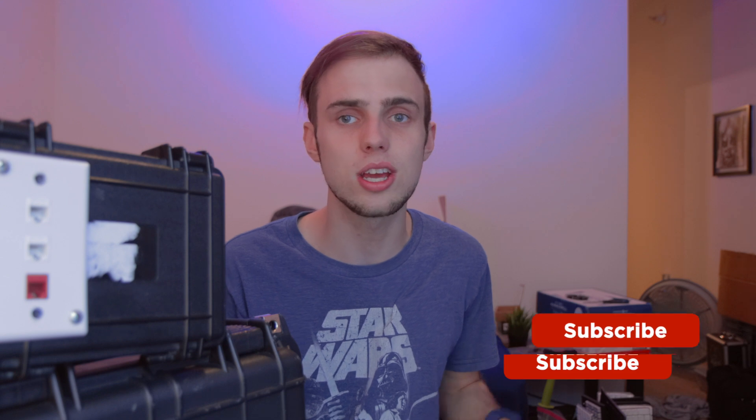Anyway, guys, thank you all for watching. If you enjoyed this video, drop a like, and subscribe if you want to see more. I'll have links to the parts I used in the description below. Drop a comment and let me know — could you use something like this, or how would you adapt it to fit your needs? One change I'd like to make is having the uplink port of the baby network in a box be EtherCON so I can use an EtherCON to EtherCON cable and not worry about that connection coming loose. Thanks for watching, and I'll see you in the next one.